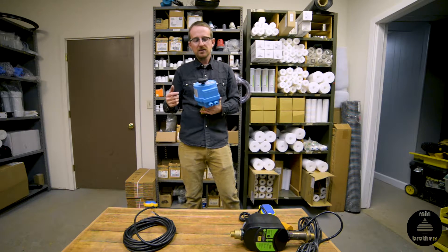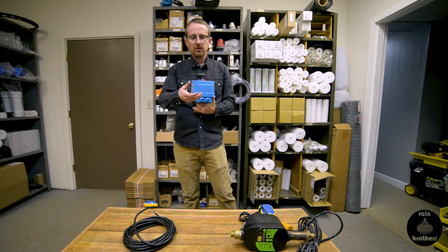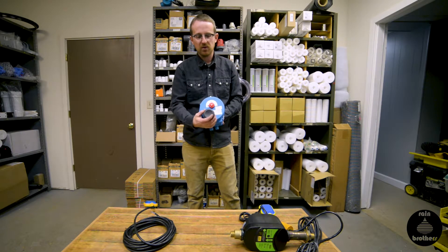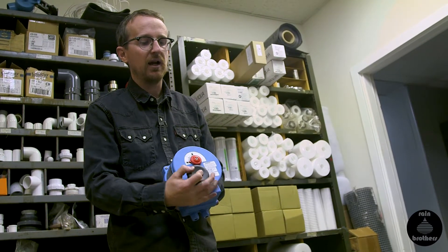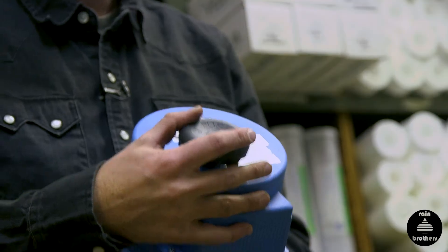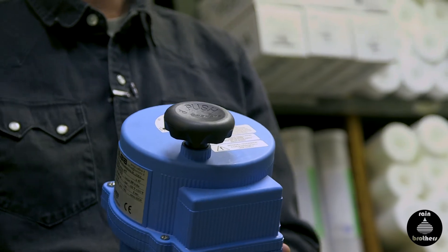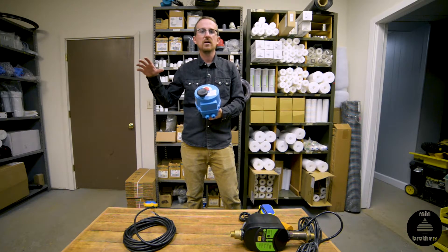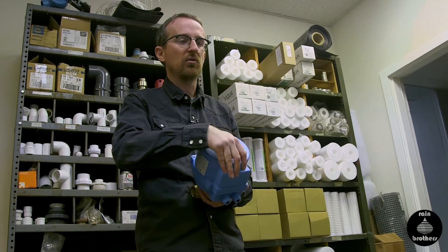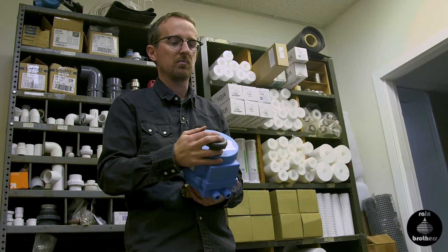In the event of a power outage, or if you just want to switch channels, you would disconnect the power going to the unit and push down on the black manual override and turn it to the appropriate channel — whatever you want it to stay at. During a power outage you probably don't have pressurized water from your cistern because there's no power getting to the pump, so you would override this and turn it to your secondary water supply, your city or municipal water supply.